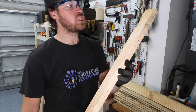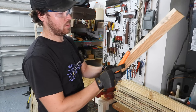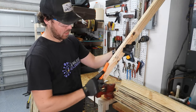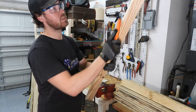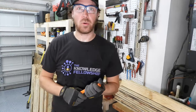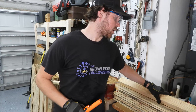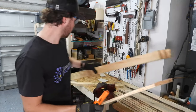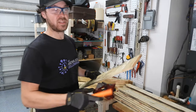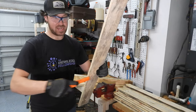I'm not going to show it all, but just to tell you what I do now: I go through and check each one. I go through with the pinpointer here and just check to make sure. Now again, there could be something deep down in there that I don't detect, but overall that one's pretty good. I'll check it closer. I don't know exactly what I'm gonna do with each one of these boards, or what kind of cut I'm gonna make, so I don't need to be super precise right now. But here I'm checking some of the ones that aren't the slats, to see how our little drill job did. Remember, little metal detector here. So far so good. You want to check each side, at least with this pinpointer.